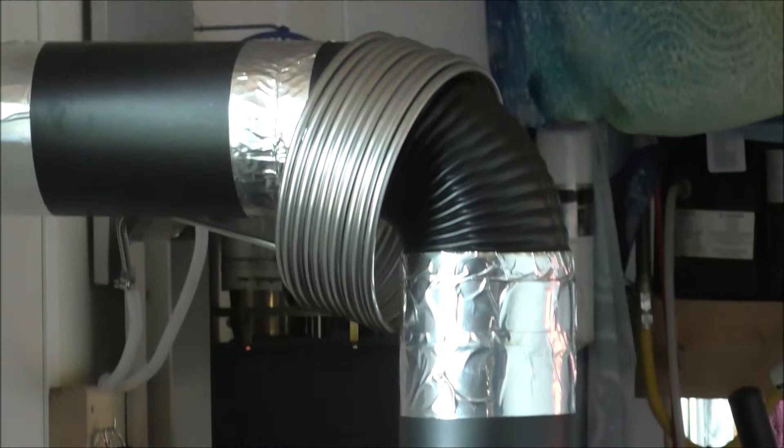I can show you right here — my tubing is just free-floating on top of the flue. It's a stainless steel pipe there. I'm not too concerned about it being tightly wrapped around the flue because I don't want to bend and kink it, and at least half of it is in contact with the hot flue. The tubing that runs off of it is silicone, which is important because silicone can take the heat really well. Further on, I'm going to rig up something like this — a check valve — and this system is going to be electricity-free.